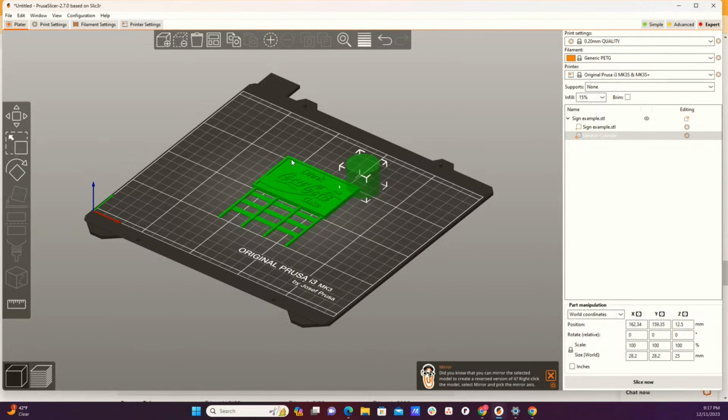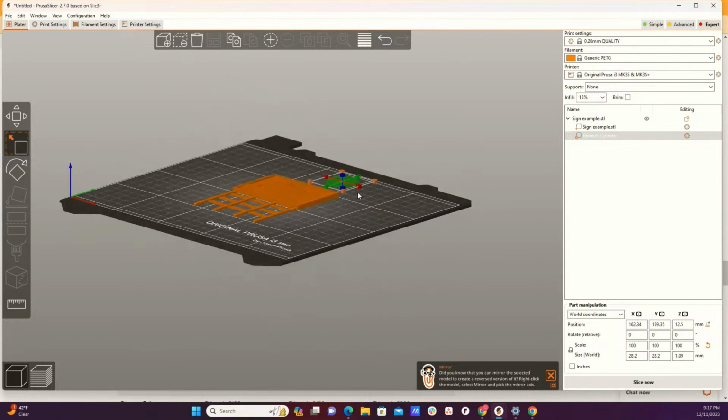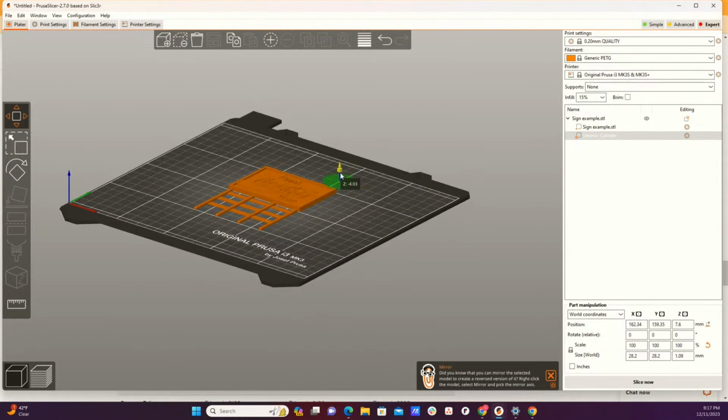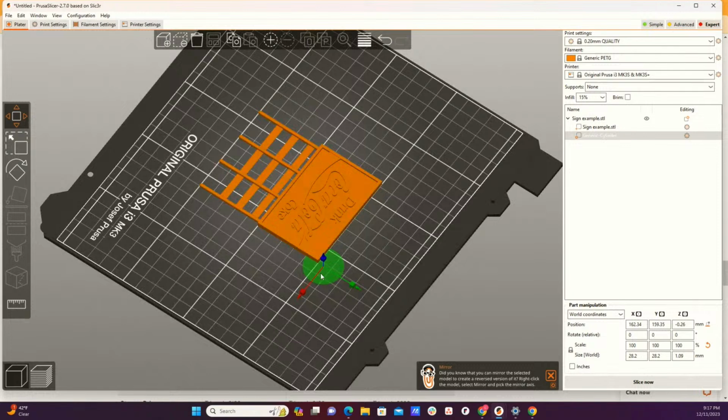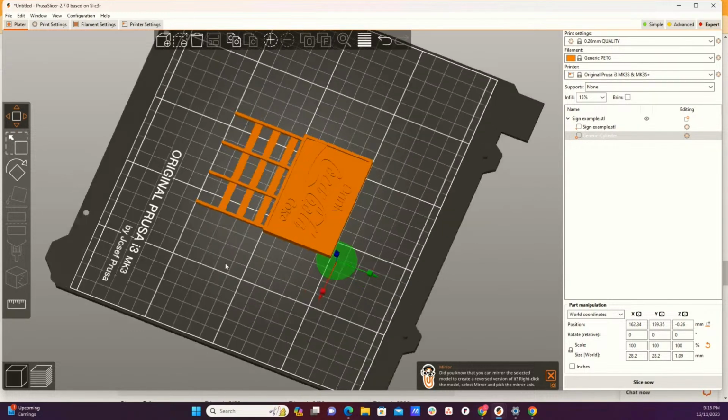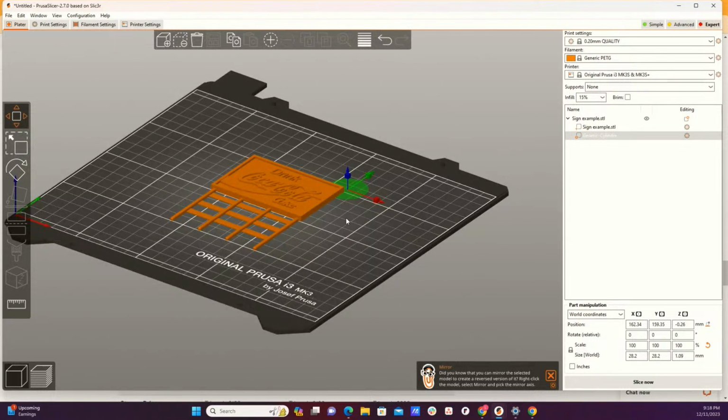But another thing you can do instead of a brim, let's say he used a brim and it's for these corners, right? You can do something called mouse ears. If you make this really thin, and then you put it down on the corner, whatever you're having trouble with, it'll have all the surface area that acts as a brim just for this one corner. So you don't have to worry about peeling the brim off anywhere else. Even if you had the skirt, you could still do this, and it will give him that brim effect on the trouble area. Sometimes you can learn little tricks like that to help prints that are stubborn and want to warp or not stick, ending up coming off the build plate or getting ruined.